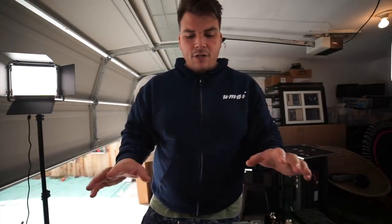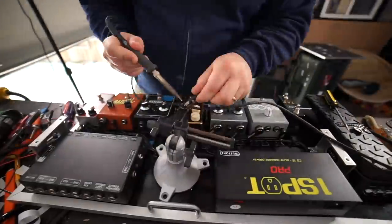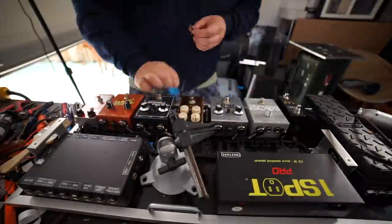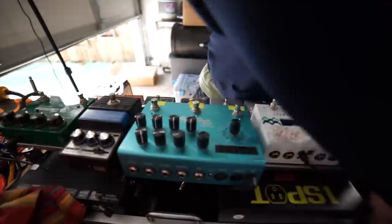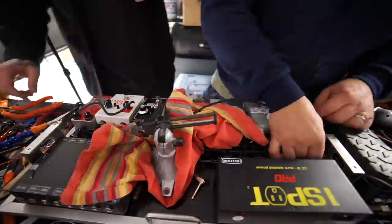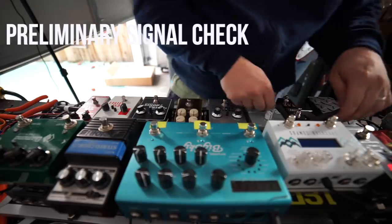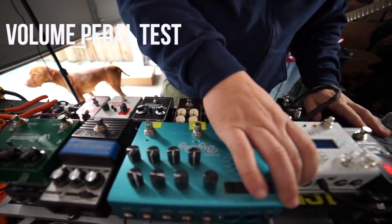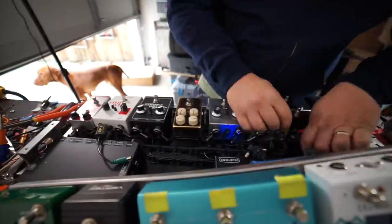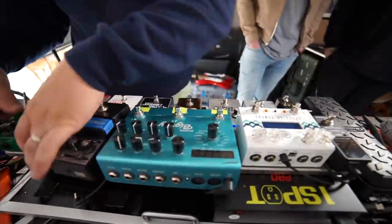We're on day three. We got everything dialed in as far as power is concerned. We're going to go to audio and testing today — it's about 10 in the morning. What I'm doing is trying to make sure that I'm using as much of the pre-existing cables as possible so that I don't have to solder as many cables where it's not appropriate. I'm laying out nice straight lines and sometimes I put a towel over the pedals so I don't damage anything when I'm soldering stuff that's real close to the base of each pedal, just to keep the paint together. I'm just dialing in the very end of the first row and getting the insert position ready on the interface so that it can break out between the first and second row if you wanted to add in additional pedals.